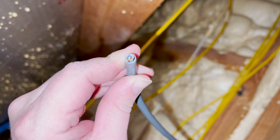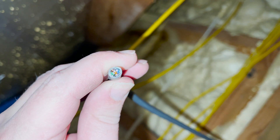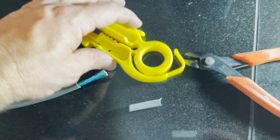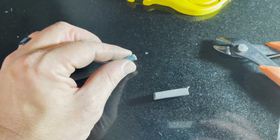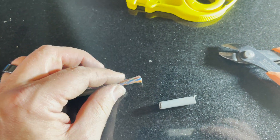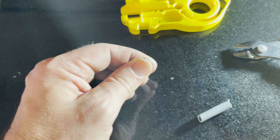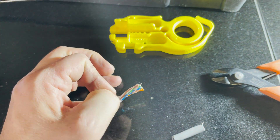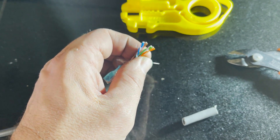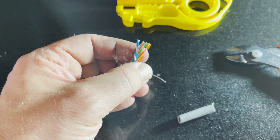As I was routing it, I noticed a metal sheathing edge that was quite sharp. When we go to recouple the two ends and remove the plastic sheathing with our simple wire cutter, it's very thick aluminum foil. We roll that back and it reveals there's also a clear plastic layer underneath. Once we pull that back, it reveals a standard Cat5 cable with what appears to be a ground wire, though I can only make an assumption — I'm not sure.